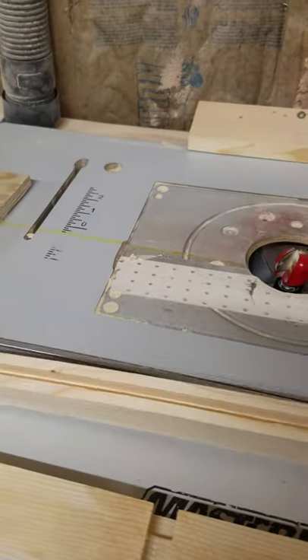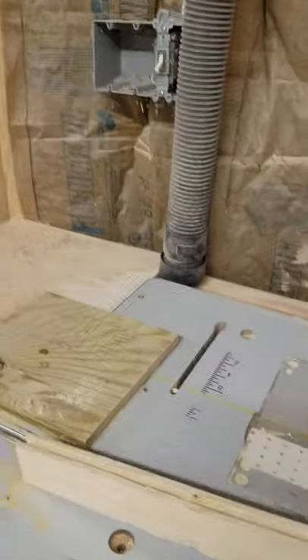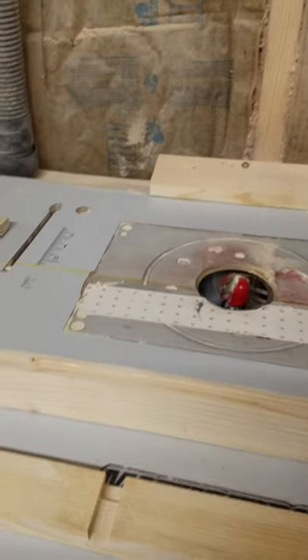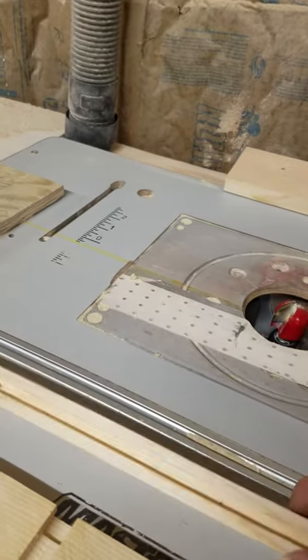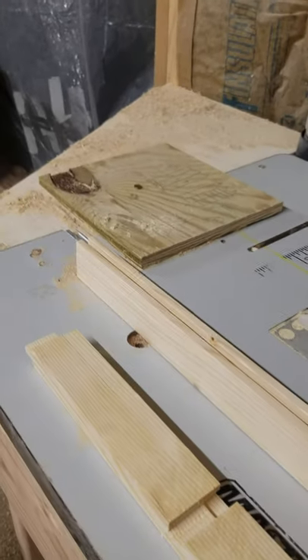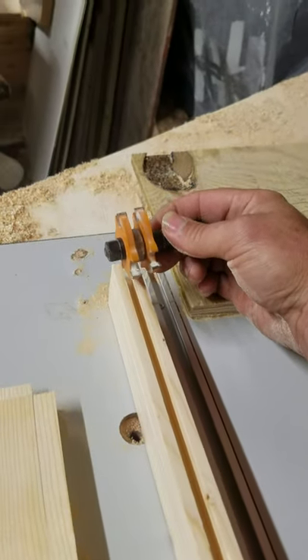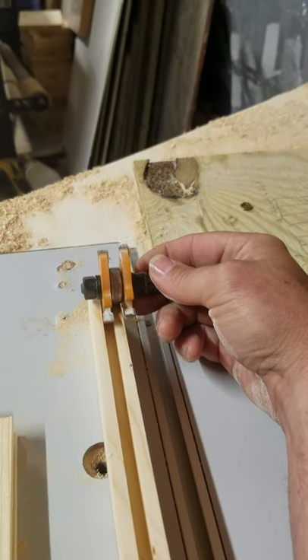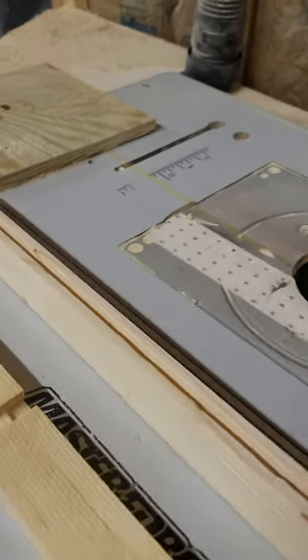What this allows me to do is cut a channel in that long strip of wood that you get off of cutting a deep. You get a 19 and seven eighths inch long piece of wood, which is perfect for your inner cover. I'll set my router table up with the bits in there and the fence so that I can just do that half inch slit down the wood. I set the depth so that just that top blade cuts down the center of that piece and creates the initial run. I'll go ahead and process up like 120 of these so I can do a 60 inner cover run.